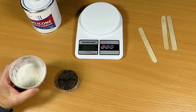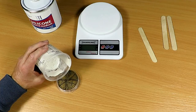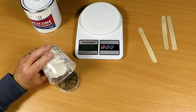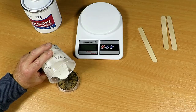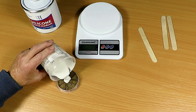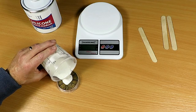As you can see, there's loads of bubbles in here — they will rise to the surface. What I do initially is just pour it very slowly into the middle of the mould. When it flows into the mould it will start from the middle and just work slowly outwards. These initial bubbles will come to the surface on top of this moulding, which means the contact zone with the metal seal will be, hopefully, bubble-free.